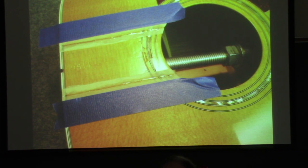So that's my take, is I just feel that epoxy is the best adhesive. Now, if I've got an older guitar, like I said, if it's 50s, 40s, I really won't use epoxy. It just seems like not the right adhesive to use unless I really have to. And no clamping? No clamping is needed, no, because everything has been realigned with the spreader. It's right where I want it to be. If for some reason, before I put the tape down, I have the spreader in place.